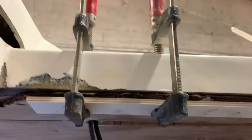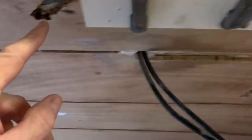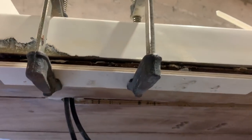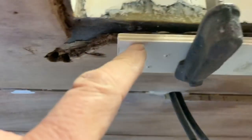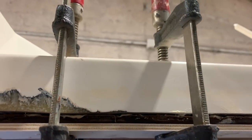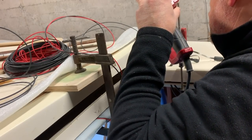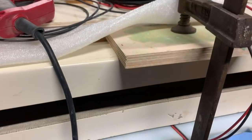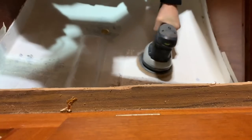I glued this part of the boat because some water was probably penetrating here and damaging the plywood that is the base for the new panel. To fix this, I am closing this hole with epoxy resin — you can see the panel is already glued and tomorrow it will be ready. Meanwhile, I drip some epoxy resin into the old holes. It's quite cold, so I use warm air to make the resin more fluid. My panel is on the way and tomorrow we will see the result.